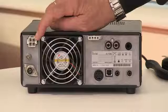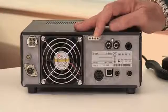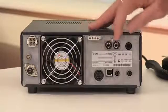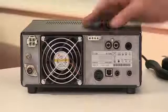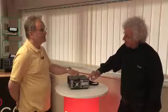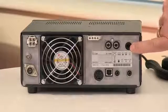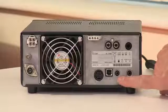On the back you've got the standard four-pin power plug for 12 volts DC, the antenna socket, the standard ICOM four-pin remote control for something like an AH4 tuner if you want to tune long wires or whip aerials, a couple of legacy phono sockets for ALC and linear switching — it's got a relay in there for switching, so that's a bit more bombproof than transistor switching. You've got a standard quarter-inch key jack, a socket for an extension speaker, and a socket for the CI-V, the ICOM proprietary remote control.